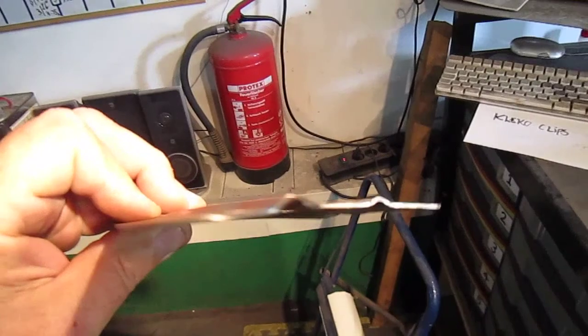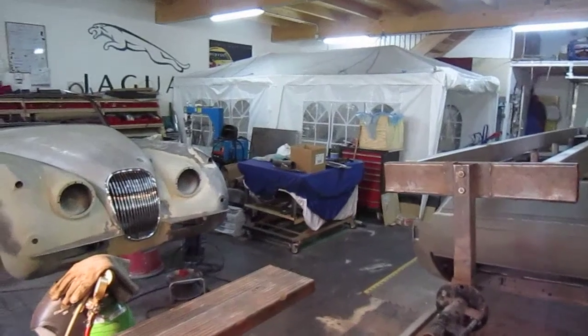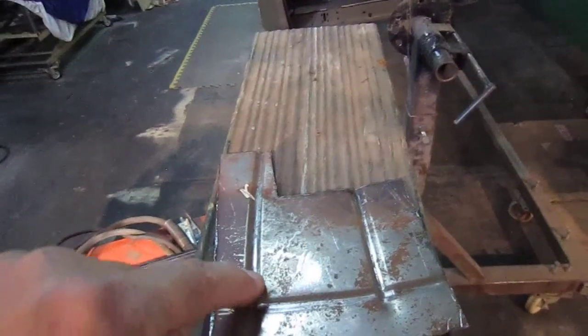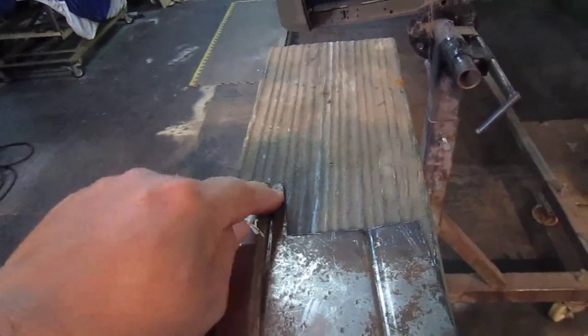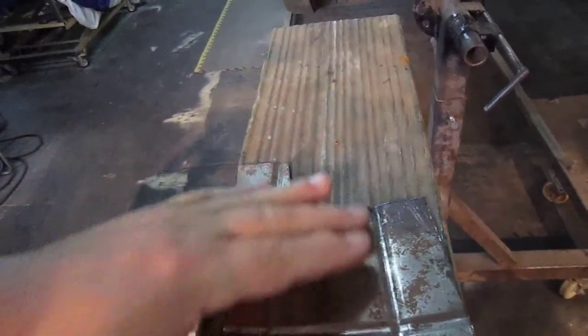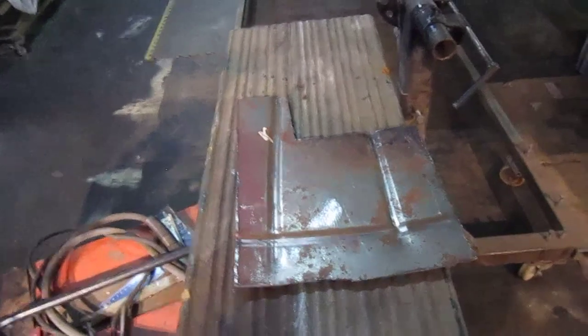One last little tip with a bead roller: if you're doing a bead — you can see this is the 2mm stuff we've done, the profile's pretty good and it's thick — if you have an English wheel, it's a good idea when you're doing beads to just run the metal up and down a few times along the line you've drawn. What it'll do is pre-stretch the metal, and then when you put it through the bead roller, because you're taking this dip in it, the panel won't warp — it'll keep the panel straight. I get most of these tips from YouTube, talking to somebody, or checking it out on Google.